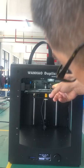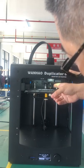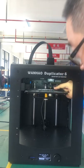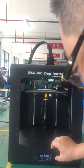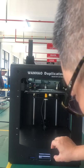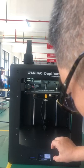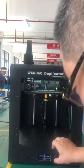Hi, when you receive the printer D6 Plus, if the extruder is printing in the air — which means there's a space — this is because you haven't done the leveling. So let's do it first. Abort the current print, go back to manual and maintenance.